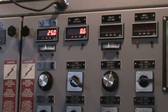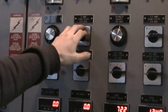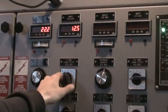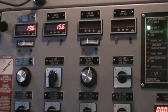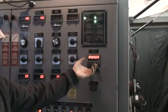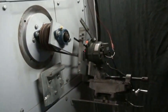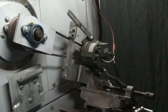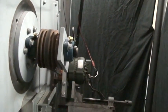Because this unit can test such large alternators up to 600 amps, these other load steps are much larger, but we're only going to be using this small step since it's a 30 amp alternator. We can add another 5 amps, and we see that the voltage is dropping, indicating that this particular alternator has a problem with the voltage regulator. Once you have the load selected, you can start a timer over here and just let the unit run. We'll shut this down and move over to the starter test.